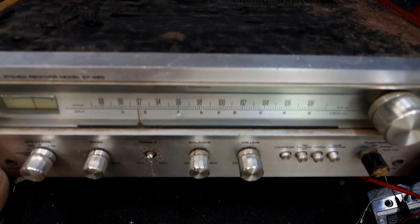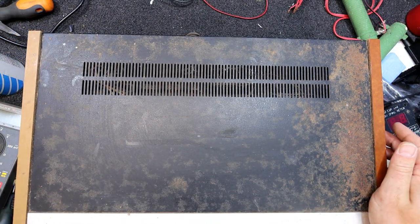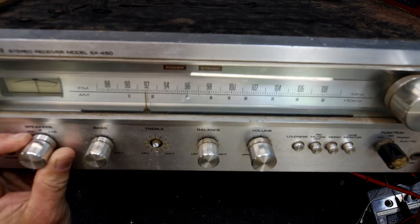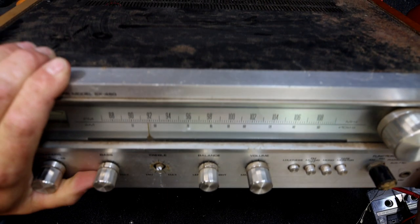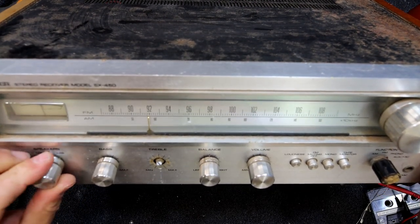The reason I bought this is because I have another one of these that I bought years ago and used as a test amp in my workshop. The actual power switch on the back — this rotary speaker switch — is faulty, so I'm hoping this one's alright, but I've just realised the shaft is actually bent on it, so that's one problem I might have to try and gently bend straight again.